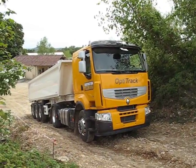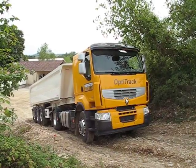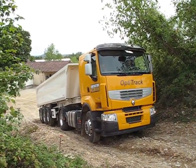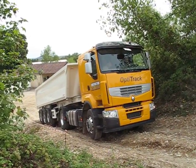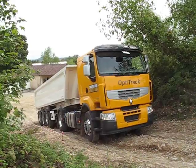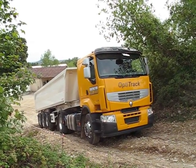You see he's spinning now in 4x2 and he can't get up. He needs to engage Opti-Track, but once he's engaged and has front-wheel drive as well as through the drive axle, he's going to be away and gone. This is a loose surface and it's an unladen truck, so there's very little weight over the drive axle, which makes it nice and skittery.